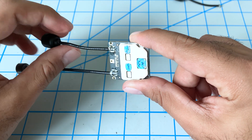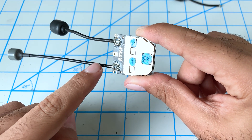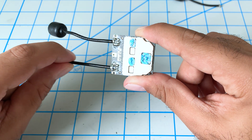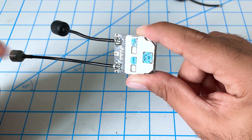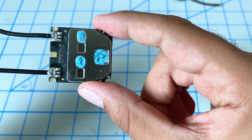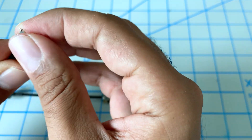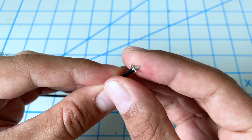After doing the first TrueRC antenna, I noticed that the TrueRC antenna does not have individual strands of cable for the outer shell. What it actually has is a completely metal shell, which is also the ground portion, with the signal cable in the center. This makes it a little more difficult to directly solder compared to the original antenna, which has individual strands that you braid together to get that strength.